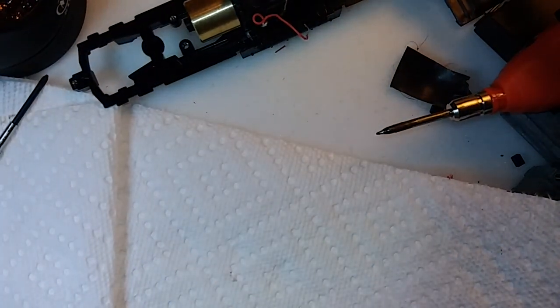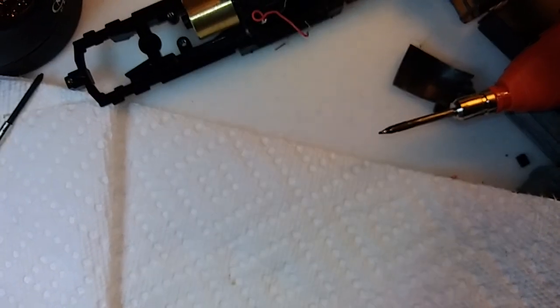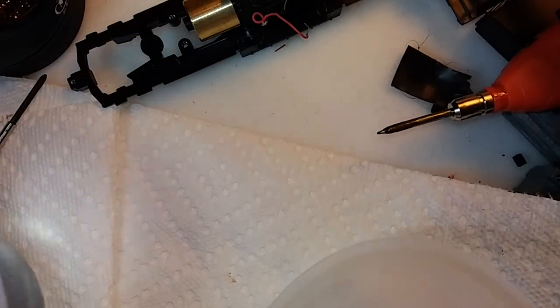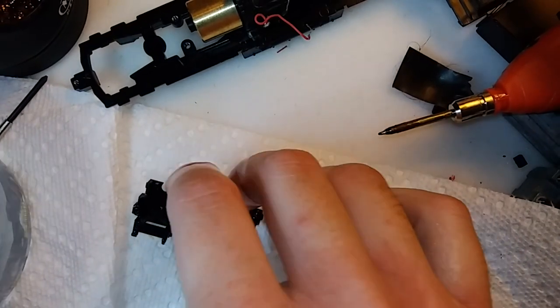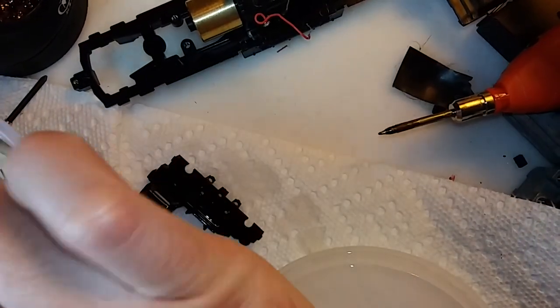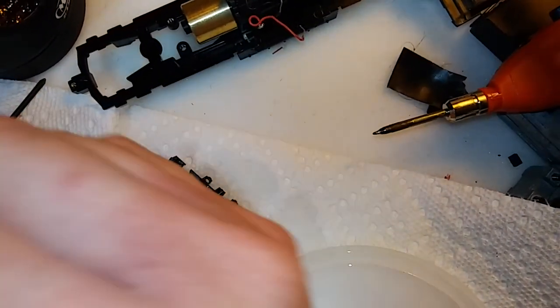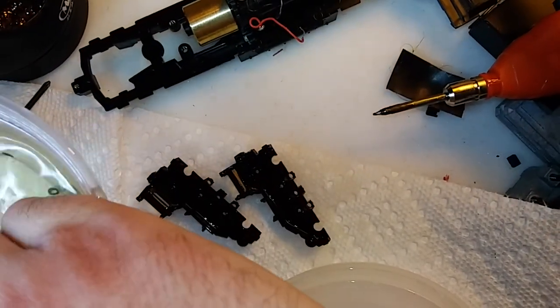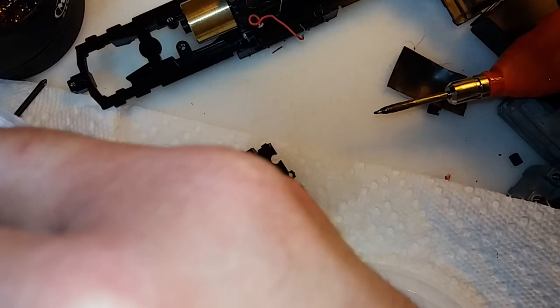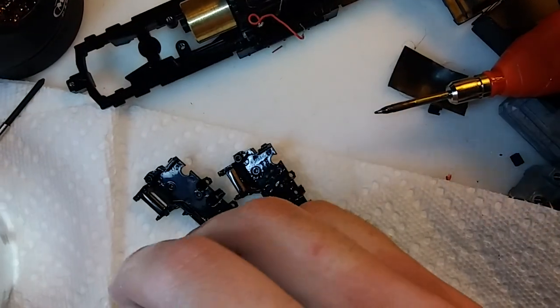With the utilization of a paper towel and a microbrush, we're now going to go ahead and do a fine clean job on these parts. Again, they've been soaking for roughly 52 hours, 64 hours I think it was in the end. Anyway, we're going to now just simply take them initially and put them out right on the paper towel, let them dry off a bit. Now, they may not look too drastically different from the way they were before we put them in the vat, but as we'll see with the condition of the alcohol water in that vat now, much has happened.